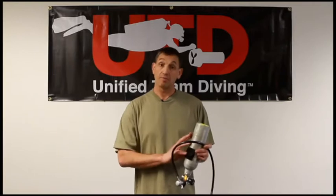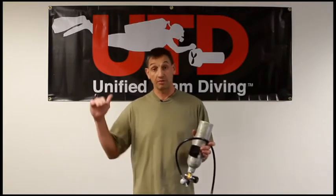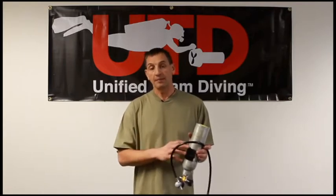The size of the bottle that I like to choose is either a low pressure 14, which runs about 2000 psi or 150 bar, because when you're filling from an argon system, you don't want to pump it through a booster, you just want to put it right into the bottle from the T or from the J bottle. So a 2000 psi system, or a 150 bar system, is the right choice.